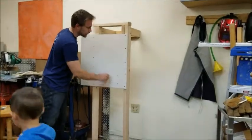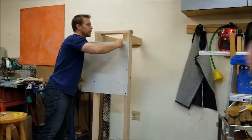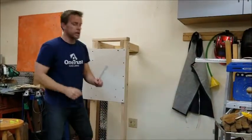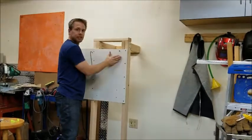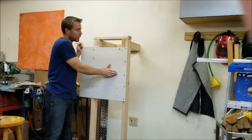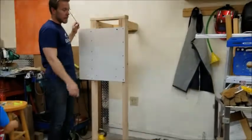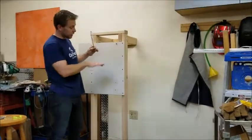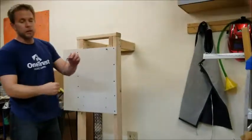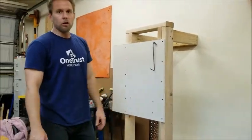We're going to start with the simple thumbtack. Obviously we don't expect much out of a thumbtack. I'm going to push it in all the way flat. I am going to try to load it as flat to this plane as possible, so we are really testing the shear force. Obviously a thumbtack can only hold shear force — it can't hold any pull-out force. Then we're going to see what the twisting-out-of-the-wall force would be. I have this metal bracket so we can apply weight.